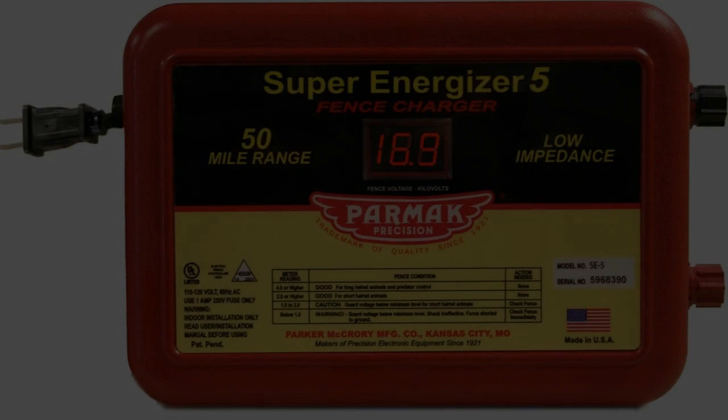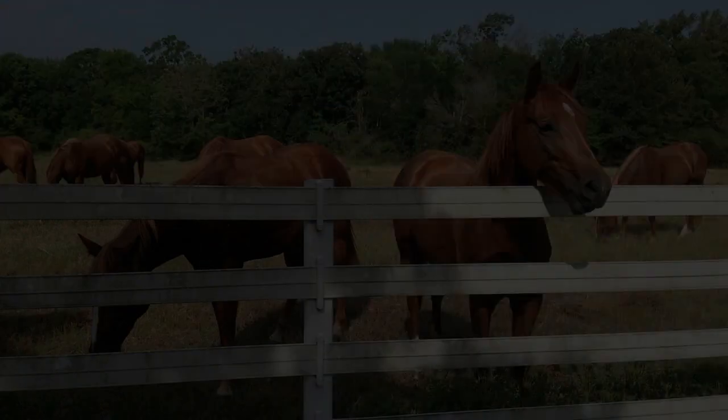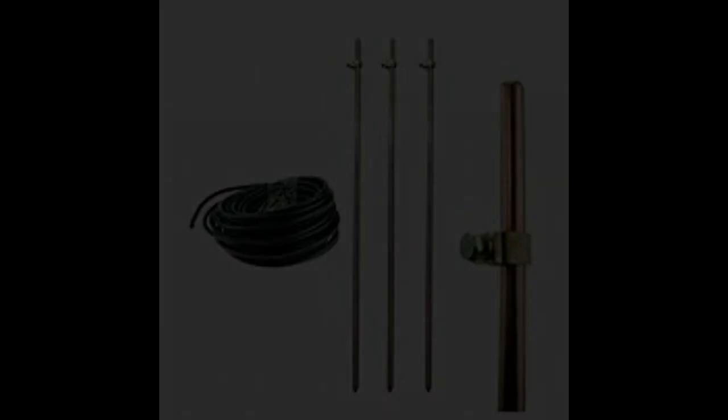Here's an electric plug-in fence charger — we use a really big one, like mega, it's made for bulls. This is a solar one; I have two of these as well. They're just on standby or if I want to put up a portable fence somewhere. Make sure you buy grounding rods — this is rebar. You can use rebar or copper rods, but you need up to four feet of these into the ground to keep it grounded. This is a four-inch electric tape — that's huge. These are the step-ins and you can use wire or up to two-inch tape with these step-ins. This is electric fence too, and that's PVC posts that the wire goes through.